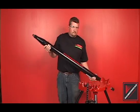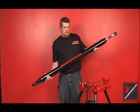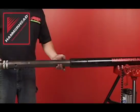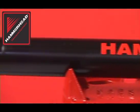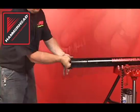Perform a tip test to assure the striker is sliding freely within the body. Tip the tool and the striker should float freely from one end to another. Following a regular service schedule will keep your Hammerhead Mole piercing tools running at maximum efficiency.